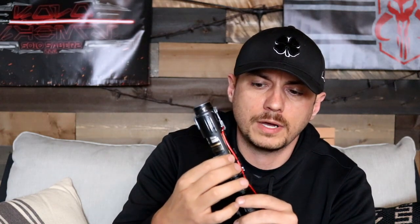Second thing, the buttons. So it's a 2-button setup, or a 2-switch setup, right? You've got your main activation switch right here, which is the blue guy, and then your bottom auxiliary down here, right? But these two switches on the prototype are hard plastic. The pillbox setup on the actual run was like a softer rubberized material. I had to do a lot of work, hand filing and sanding, to these two switches in order to get them to function properly inside the switch box.